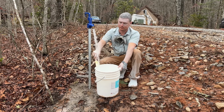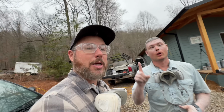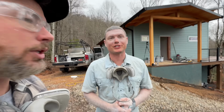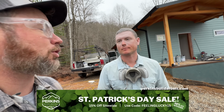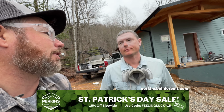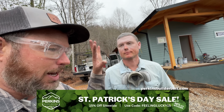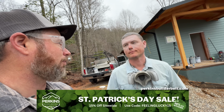Wow. We're done priming, even though the paint we have probably says paint and primer in one. Most paints say that nowadays. One coat coverage, one coat guaranteed. But with the bare drywall, I just don't think it's a great idea. It's just not going to be as good a finish if you don't get that really hard drying primer and get a chance to sand everything smooth before you paint.